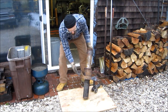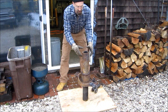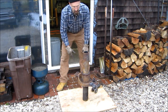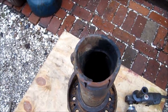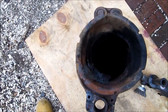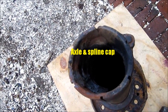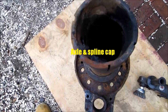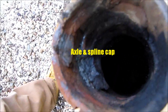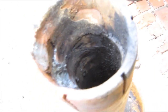We're going to start cleaning it up because we've got to separate the tube from this piece here — we're going to be replacing this tube. It is completely wasted out on this end. Here's a look down inside; you can see how bell-mouthed it is. The bearing let go and the axle was actually rubbing on the inside of the tube and raised up some material. There's a little torch cut there so they could get the axle out. Pretty chewy.